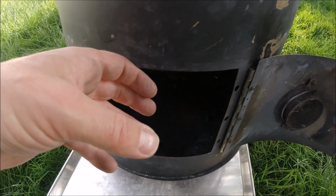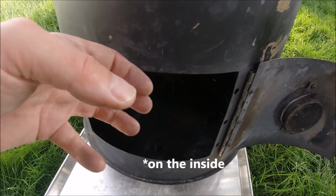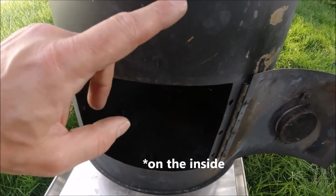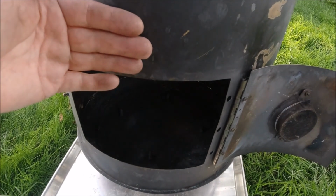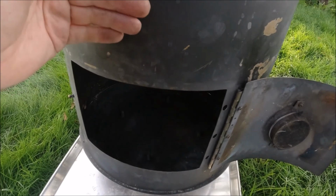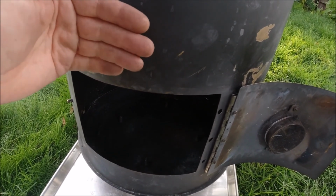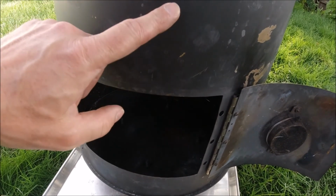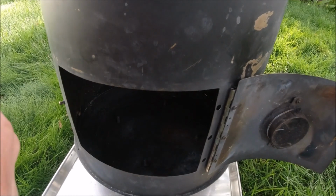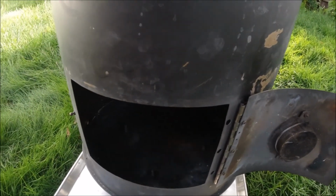stove. Paint, because it has a high emissivity, absorbs the thermal radiation from the fire, and because it's directly coupled to the metal, it readily transfers that thermal energy into the metal, and the metal very efficiently conducts or transfers that heat to the outside surface paint, and because that paint has a high emissivity, it radiates that heat very well, that thermal radiation, out into the environment.